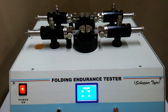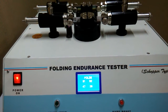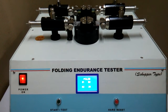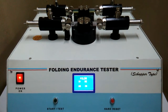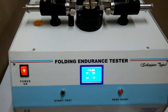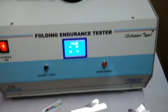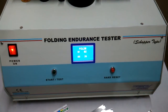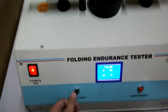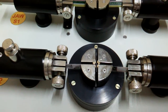One specimen is broken at 39 — that means S2 broke at 39 folds — and the other one continued, eventually breaking at 55. The difference may be due to the formation of the paper. As you saw, the aluminum foil had a uniform formation so both broke at the same reading of 12.